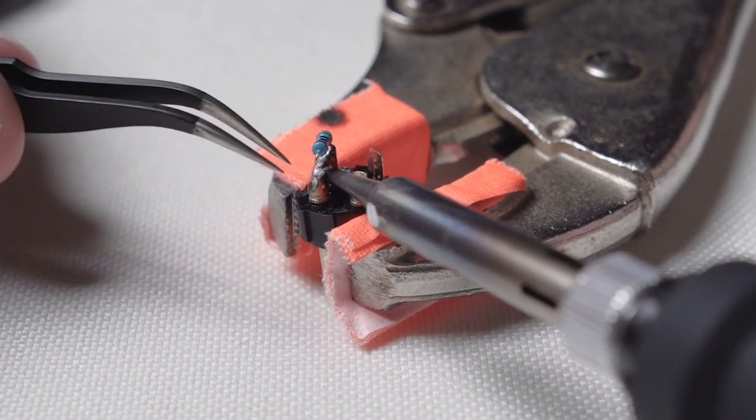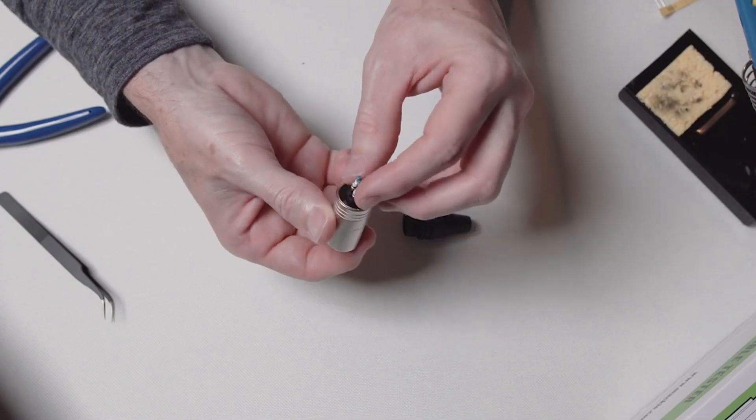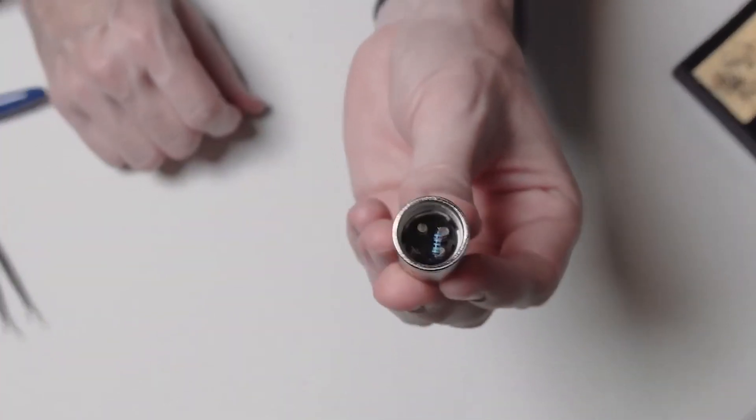I want clean audio from the gear that I'm using, and of course everything is subjective — the amount of noise that I can hear versus what someone else can hear, the amount of noise that is acceptable for my own productions. I'm going to show you what that is for me and how this device helps me understand the noise level coming from the gear versus the ambience of the recording space. This is a 150-ohm resistor inside of this XLR plug, and it's going to mimic a typical standard dynamic microphone which needs a lot of gain, like the SM7B.